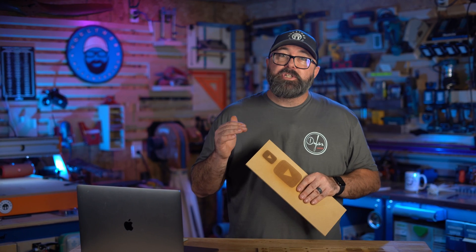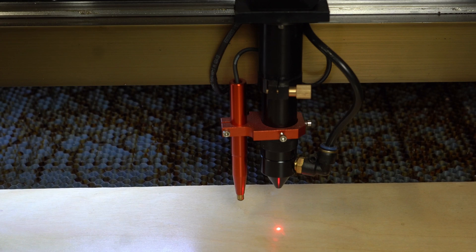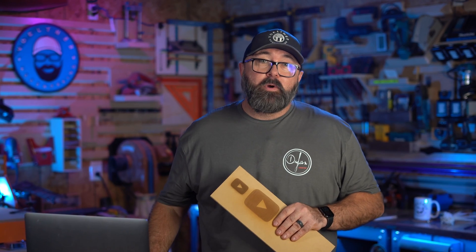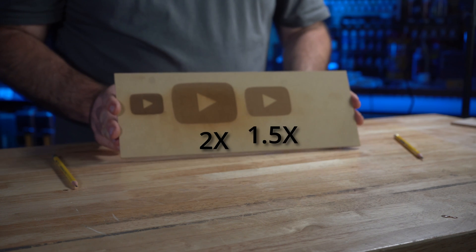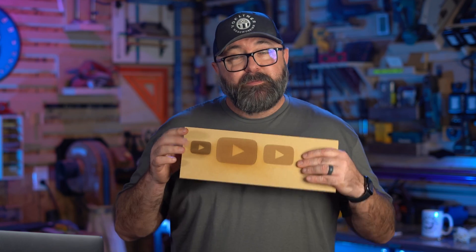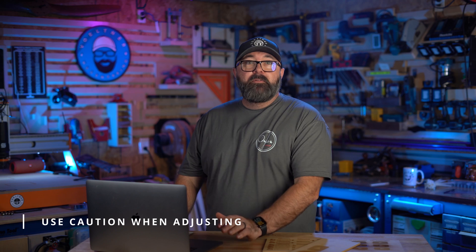You could lower the bed on your machine and put the laser head slightly out of focus, increasing the distance to your workpiece. If you do this, you'll want to increase your interval because the laser will now be out of focus and produce a wider beam where it connects to the workpiece. I ran this quick test by doing that — the interval is set to 0.2. I was able to engrave the same image at 1.5 times the size in the same amount of time as the first test.